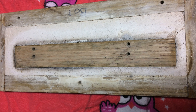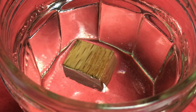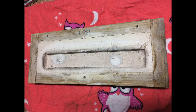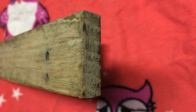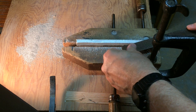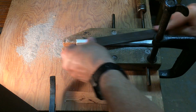If only I could shrink the pattern after the plaster dries, it would come out easy. Then it hit me — soak the pattern in water to make it swell up. As the plaster and wood dry, the wood will shrink, making it easy to remove. So I made a new pattern out of bare wood with oblique angles on the edges that need to be released from the mold. Oblique angles are angles greater than 90 degrees. It's easy to file the edges square on a finished casting, because I have to clean it up with a file anyway to make it look good and ring like the other bar keys.